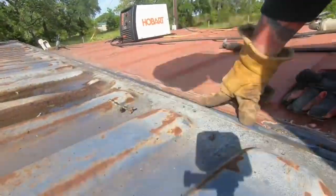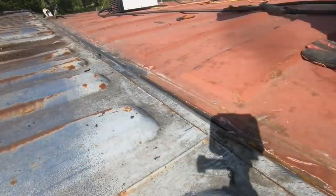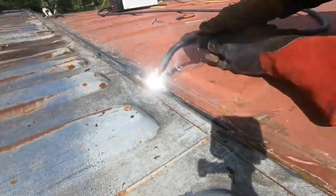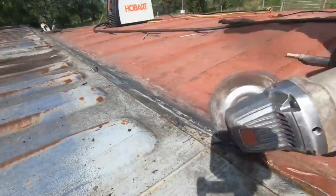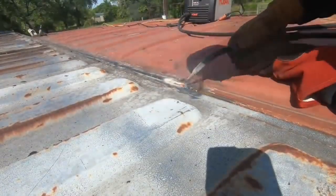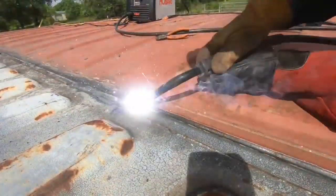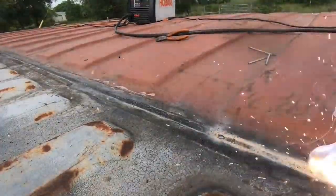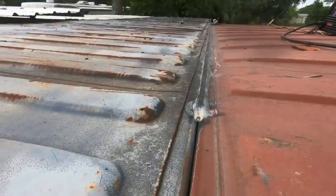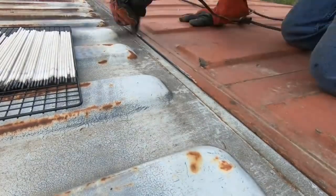So we're up top welding the two seams together. Just get a C-clamp and pull them tight together, and then you can start welding. I'm using the MIG welder with flux core wire because it's pretty windy up there, and I run the full seam because there's less likelihood of dripping. I'm having some problems because my gap's too wide, so I'm using a stick as filler along with the filler wire while I run that bead. As it happens I ran out of wire, so I've got to switch to some stick welding — I'm not a very good stick welder, but here we go.